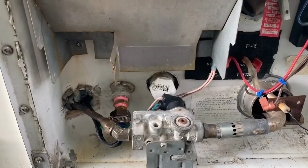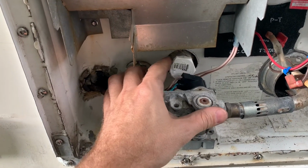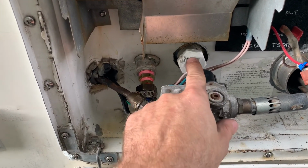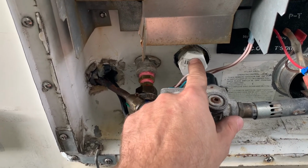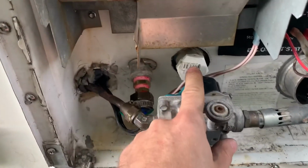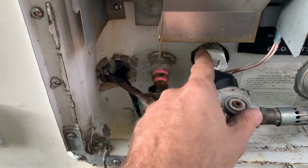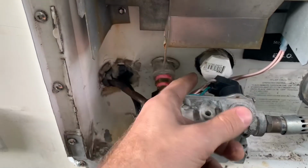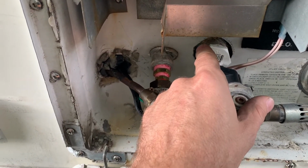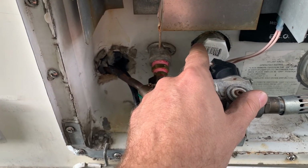There you have it. So one thing I forgot to mention is that obviously this outlet was designed to hold the other gas regulator, and there's a thermostat going in there, and that's what controls the gas regulator for the gas only powered hot water heater. Anyways, this hole wasn't there. I just cut that open with some tin snips to allow this to come through. Otherwise it would have hit the cover here. So that's the only difference in the two tanks. And obviously I had to add a plug, some Teflon tape.